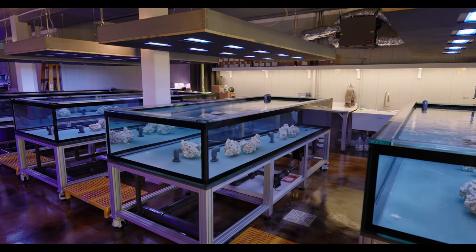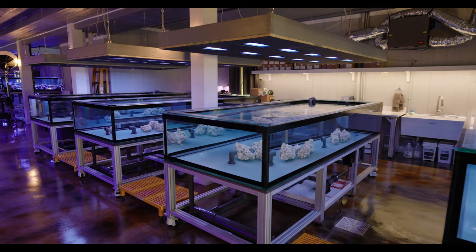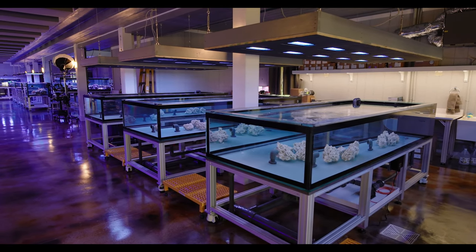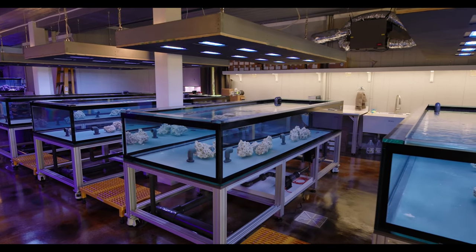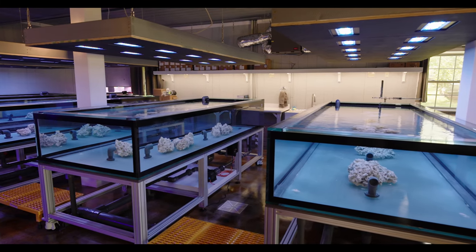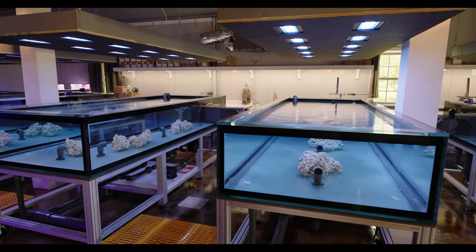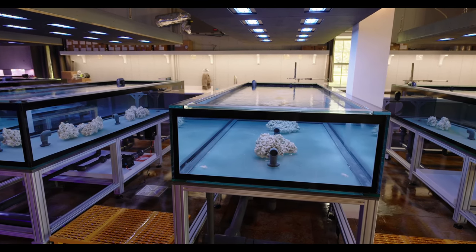You can get away with using marine grade plywood. We don't do that here because I pretty much want to avoid as much of that as possible that might come into contact with water. So the solution we came up with between the 4 pound foam and the type 1 PVC pretty much eliminates any chance that it's going to get destroyed by water.